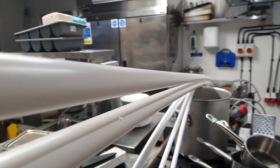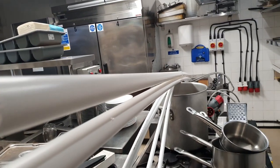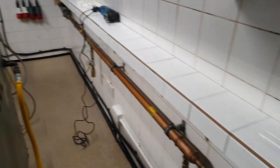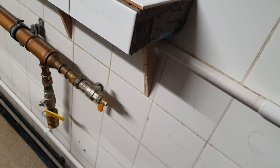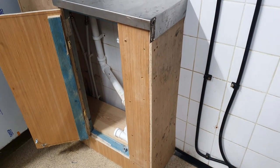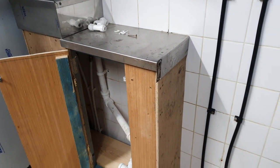Good morning ladies and gentlemen - we're chooching the morning pipe and cracking on with some plumbing work, which is going to entail providing a hot and cold water feed over here where I've conveniently indicated hot and cold, and also a waste pipe. We're going to sling it below this gas pipe over here and run it all the way across into this yet-to-be painted or tiled cupboard, which boxes in the pipework at the bottom of the sink.